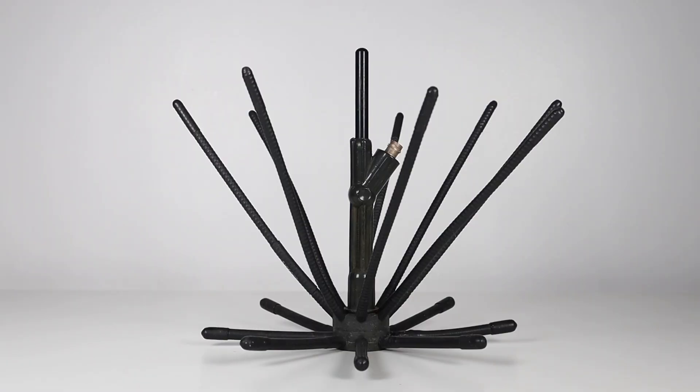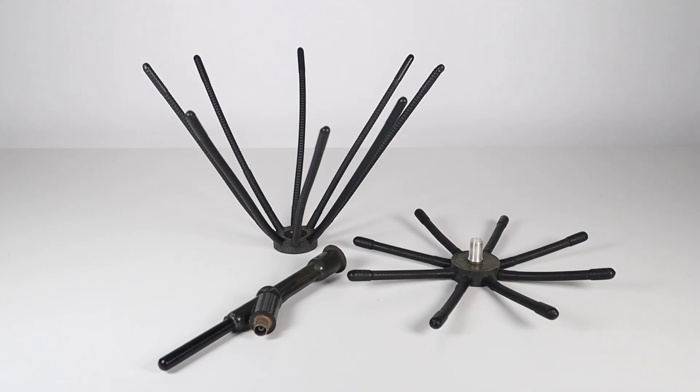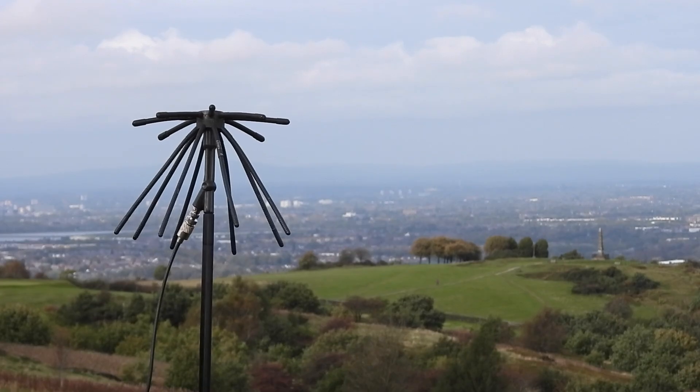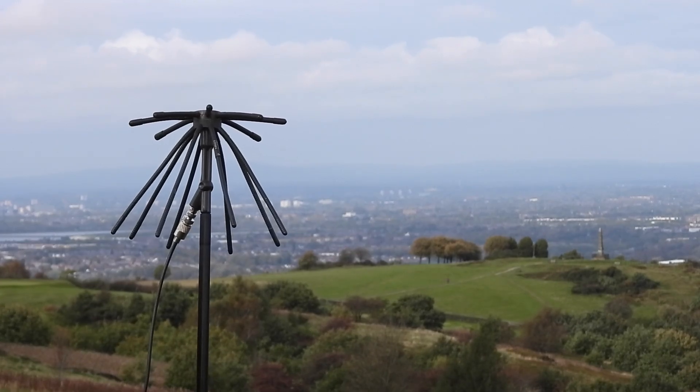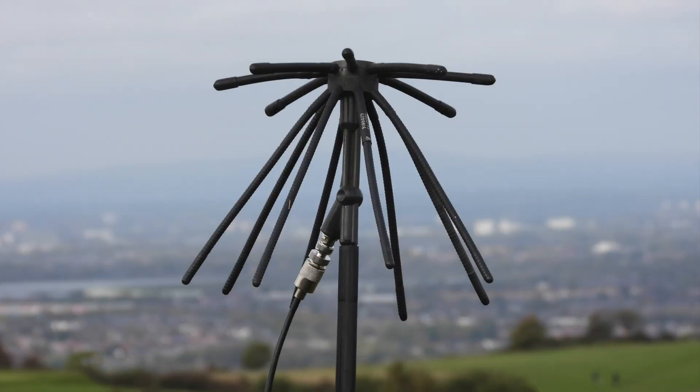The antenna gained the nickname 'Bob Marley' amongst the military and amateur radio community, and I can't think for the life of me why. It has a stem which supports the antenna on the top, which screws into place using a TNC connector. The cone slides onto the connector before the stem is screwed on, pressing it between the stem and the disc. The connection to the radio is made using a simple BNC connector. These discones are a fairly rare piece of kit in good condition nowadays, but with a transmit range of 255 to 475 MHz and extremely good receive capabilities on a much wider range of frequencies, it's good for many uses — including military airband, civil airband, and the 70 cm amateur band. I actually managed to open up a repeater 60 miles away using just a handheld on this antenna from my studio at home.